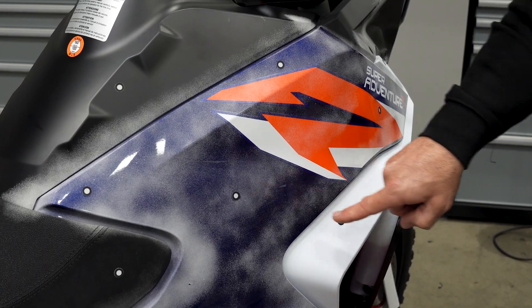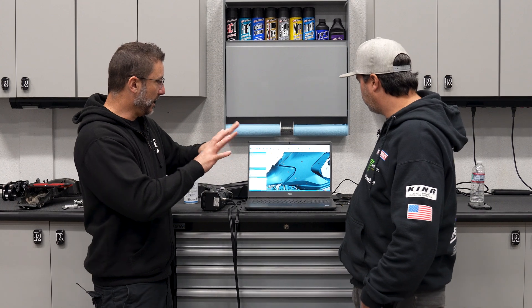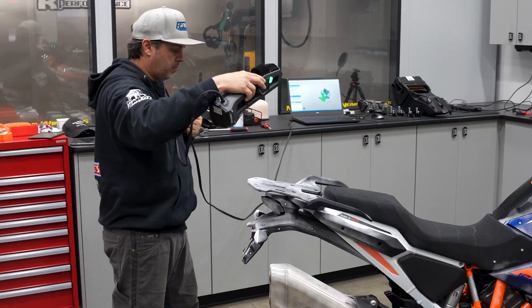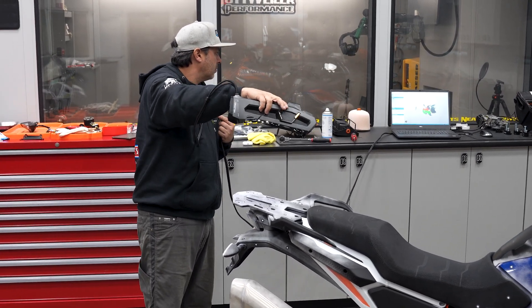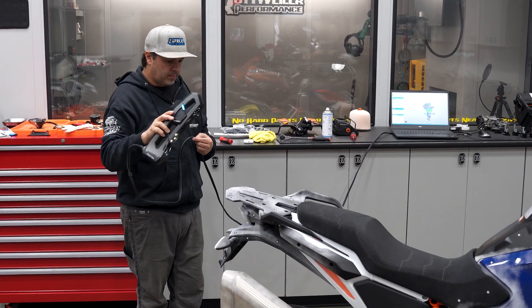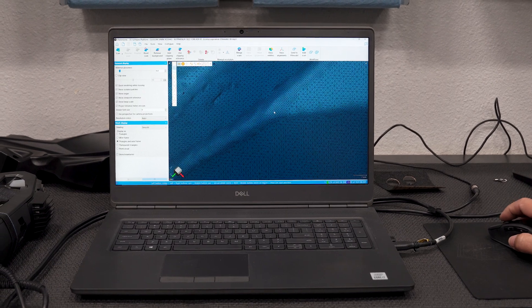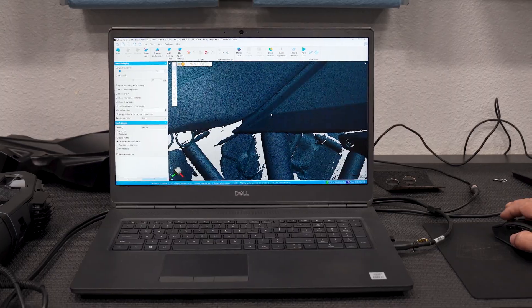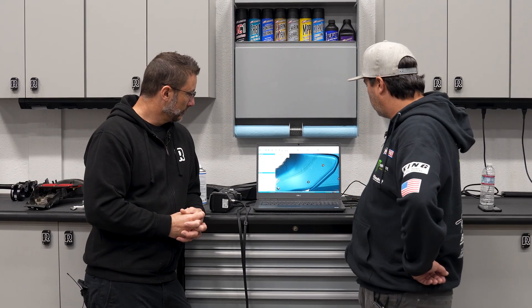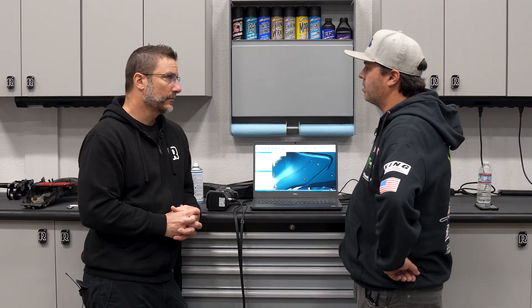We have these little stickers that you can see inside this point cloud, and they help figure out exactly where the surfaces are in relation to it. When you bring the scanner back and forward and around, it takes those dots and keeps track of them to figure out exactly where the surfaces are. What we have is a point cloud — little tiny dots in space — and those three dots create triangles. All those triangles together create our smooth mesh. It's accurate down to about 10 thou resolution. You can even pick up all the stitching.